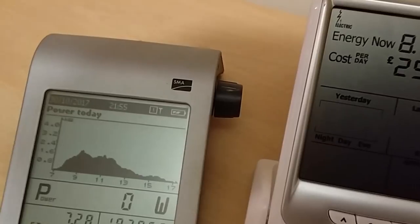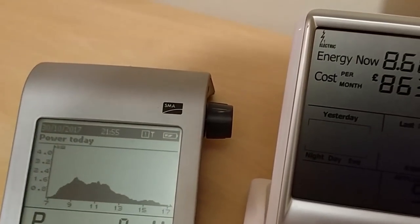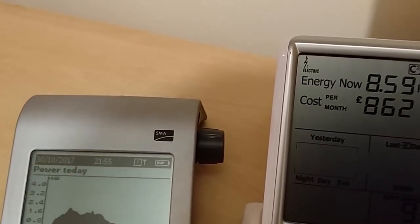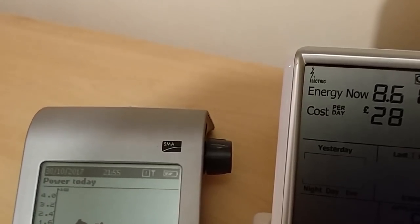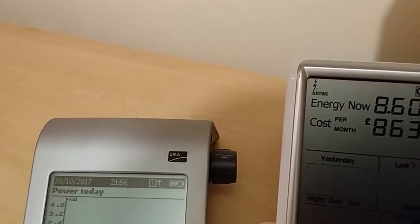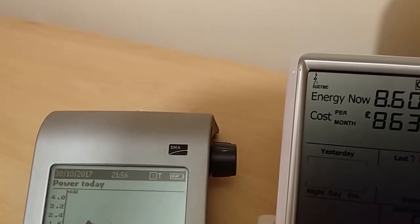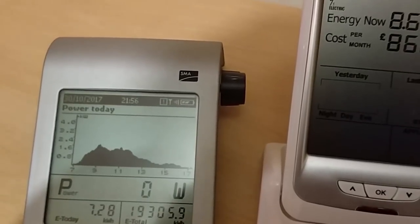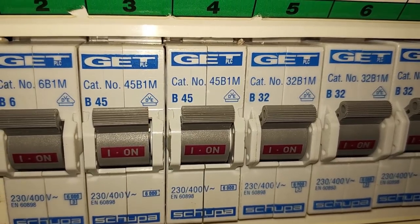On the left we have a solar panel meter showing 0 watts because it's night time, and on the right we have the current cost sensor around the electricity meter. It changes between 8.5 to 8.8 kilowatt hours — that's £862 a month, or £28–29 a day in electric costs, powering 5 D3s, an L3, and a GPU mining rig. This house is normally low energy consumption with an electric bill around £10 a day, so this is quite a lot. There's no way the solar panels can cover the mining cost but it does help reduce it a little. The mains cable feels a little warm, and the circuit breaker also feels a little bit warm — not too warm though.